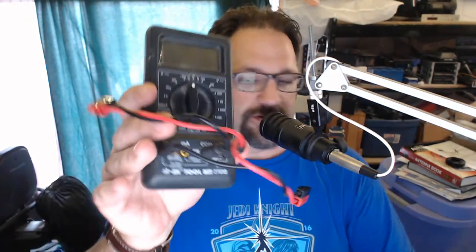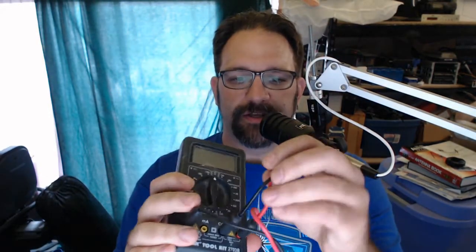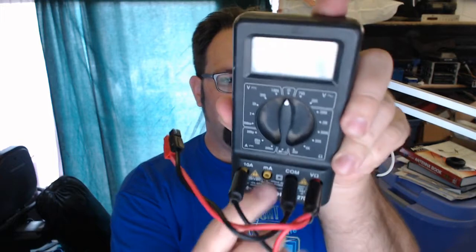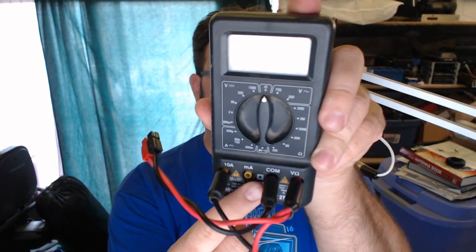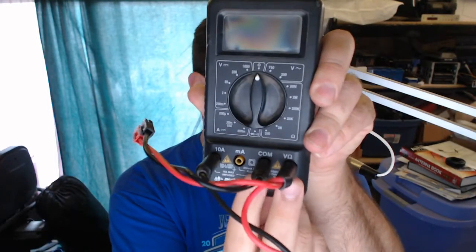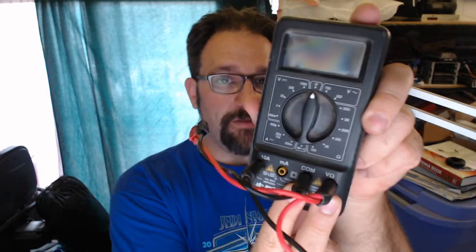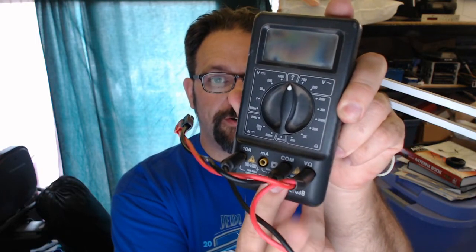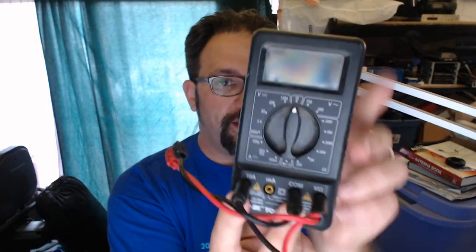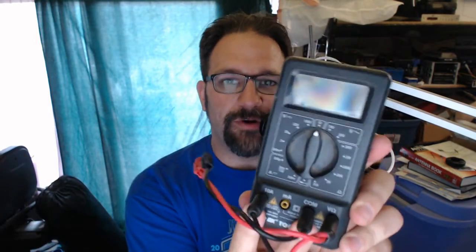That is not entirely unlike, stand by, this. So I rigged this up many years ago. This is a standard volt-ohm meter, right? And it's pretty common. They have a common lead here, and normally when you're just using the pointer probes, you hook up the black and red to these two here, and you can measure voltage. You have the common, which is ground, and then you have a voltage probe. But you also have the common and a current probe over here, and you put these two in line with what you're trying to measure.